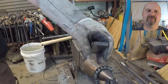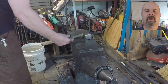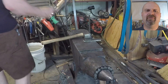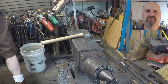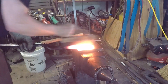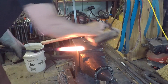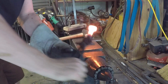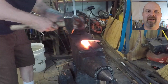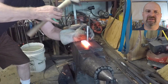This is my stamp — I believe I got it from Buckeye Engraving. I always check, because I've stamped things upside down and backwards, so I always try to get everything laid on the anvil in just the right place before it comes out hot, because you don't have much time at the right temperature. I've got it set just right and I try my best to get it in one hit. If I have to go more than one hit, I often get skips and I don't get a good stamp.